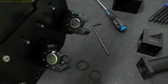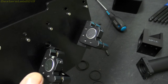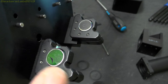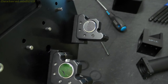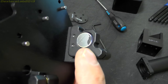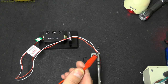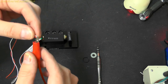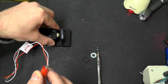Another thing I've just noticed while I was starting to clear up is that this mirror here seems to have some sort of damage or deterioration on it. I've also noticed that that one seems to be coated differently to this one — you can probably see on camera that it looks slightly green, and that one looks kind of neutral. Now I've just got this connected up to my bench power supply with five volts going into it. You just tie the white wire to positive and that turns the laser on — you can actually also use that to modulate the laser as well.